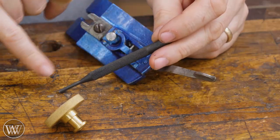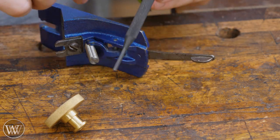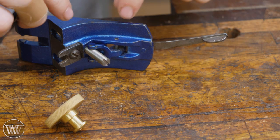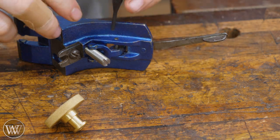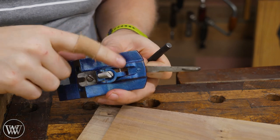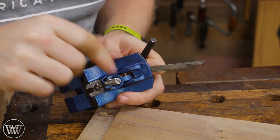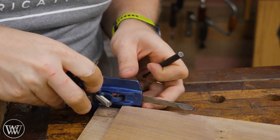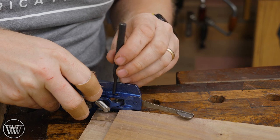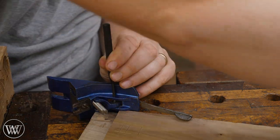You want to get a good punch to put that out — I've got links to the ones I use down below. This one is 3/32nds and it's just about perfect. You can usually get it within 1/8th but sometimes the pin is a little bit smaller. Stanley changed the size on these from time to time. Also, because this is a casting it can be very very easily broken, so this is probably the most dangerous step. I'm going to rest it and secure the casting on the corner of a piece of wood to protect it while I'm pounding.